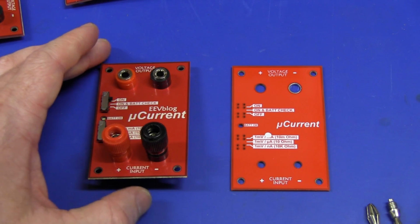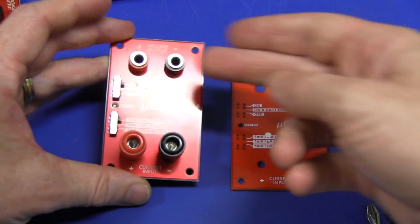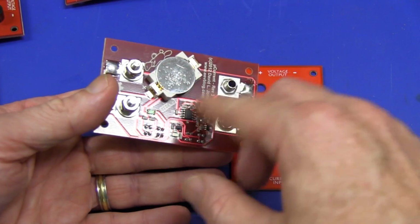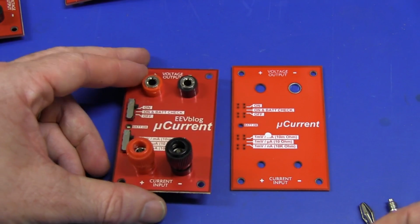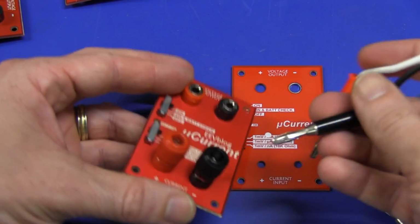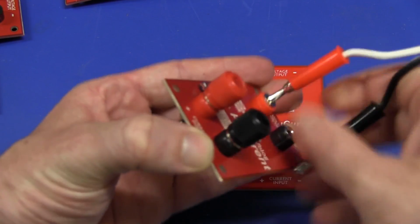Now, with a good lot of products that have to be tested, they will just have input and output connectors like this. So there's no test pads or anything on the bottom. I don't have to access the circuit. In this case, it's just here and here. So I want a jig that automatically takes some banana plugs like this and inserts them into here.